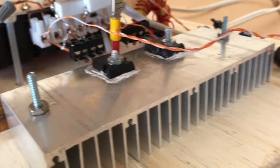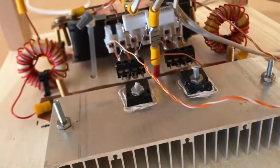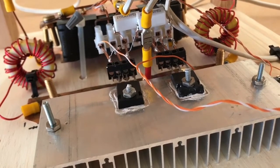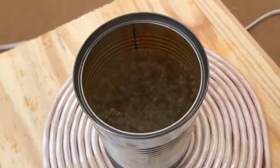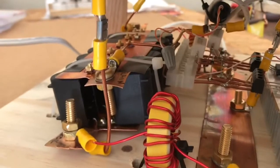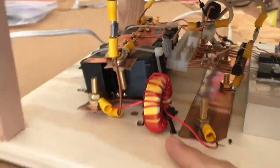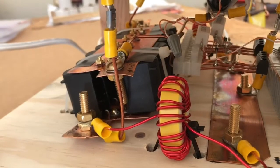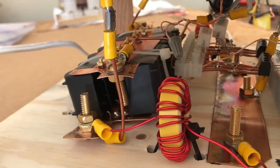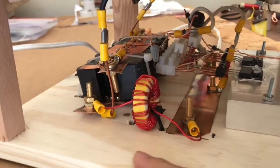I just wanted to test out a proof of concept here. I've seen posts about this and people have reported that it works — and this is a demo that it does work. I'm boiling a can of water with it. I'm using pretty much the same setup as a regular Mazzilli circuit. I've got powdered iron ferrite cores on both sides. The positive power goes through that into the tank, and the RF heats up those metal cores — they get pretty hot, you can't touch them.